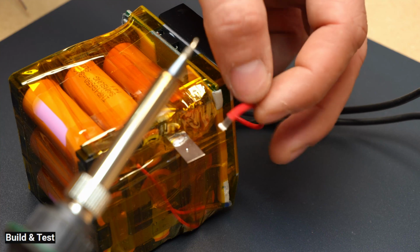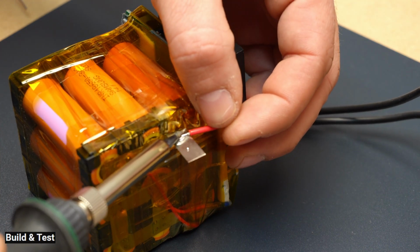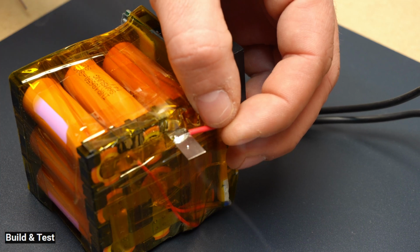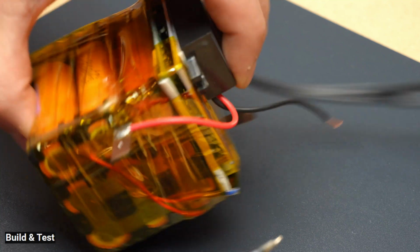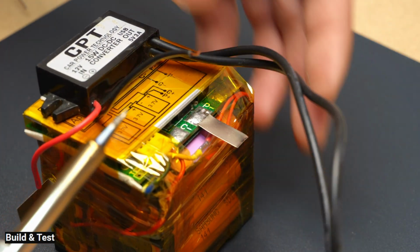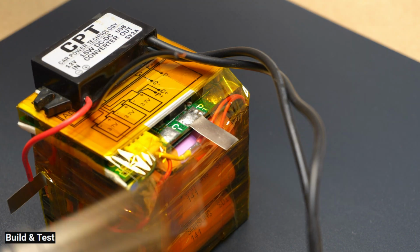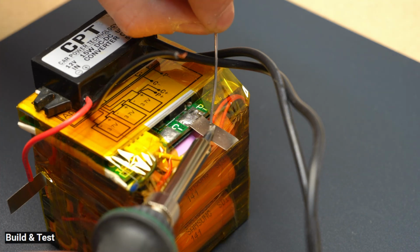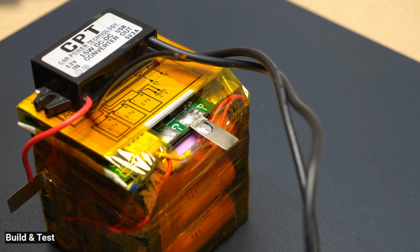Main components of the circuit: Transistor switch, the primary active component that switches on and off rapidly to control energy flow from input to output. MOSFETs are commonly used because they offer fast switching capabilities with low losses. Diode provides a path for current when the transistor is off, known as the freewheeling diode. It helps maintain the circuit's energy supply.